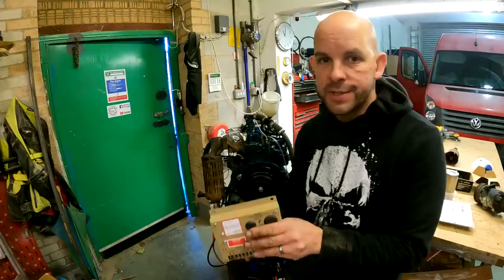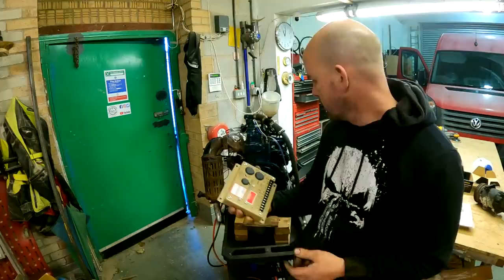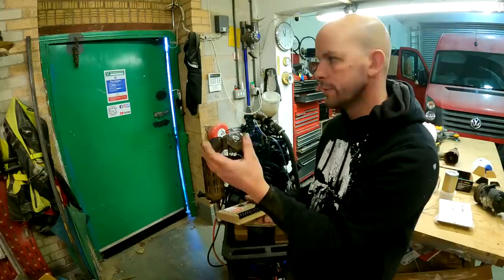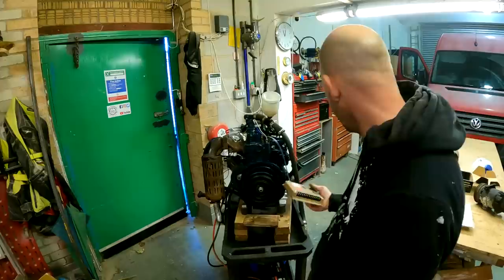The engine itself is going to be electronically controlled, so it'll maintain an RPM. So I bought this little gizmo, which is a generator speed controller basically. So we've got an actuator which will operate the throttle. That's the plan. So then we'll have a nice control panel, stop start buttons. There's going to be warnings when the engine's going to start. This will all be in a nice box somewhere. I'm not quite sure where it's going to go yet, but okay.